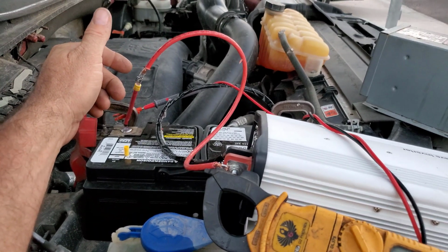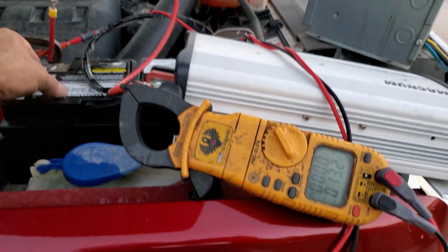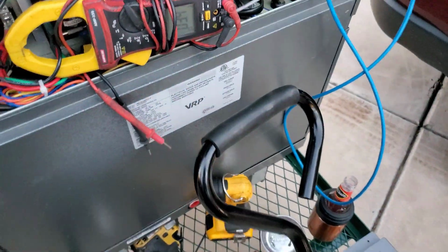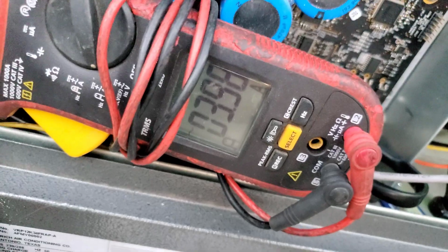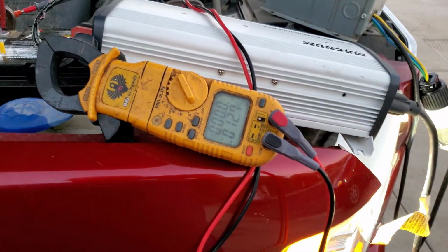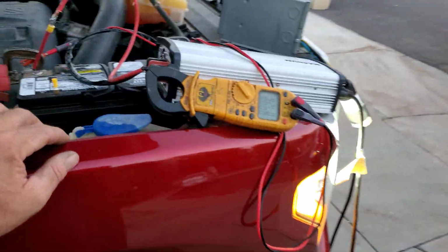It should be a fairly high output alternator, being that this has a tow package and everything, but let's see what happens here. Volts, 12.9, getting up to 3.9, 4 amps, compressor most of the way ramped up, just starting to drop down to 12.8. That's not too bad. Let's see if this connection pops off though, like a fuse. 12.7, and that's at 4.85. This is usually where it fails, and this fan's probably running balls out on this thing, I'm sure.